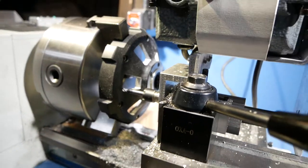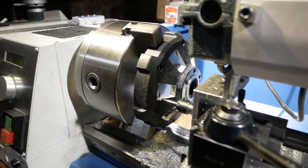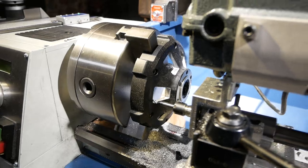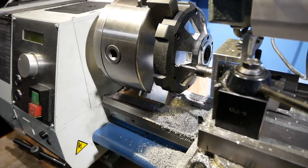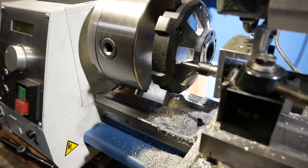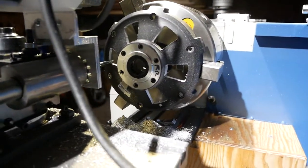So that's how I made all 6 of those openings. A rough cut pass and then a final pass. It's all a matter of counting in and out 15 and counting plus and minus 10 degrees around the 60 degree increments to get that. Pretty cool, huh?